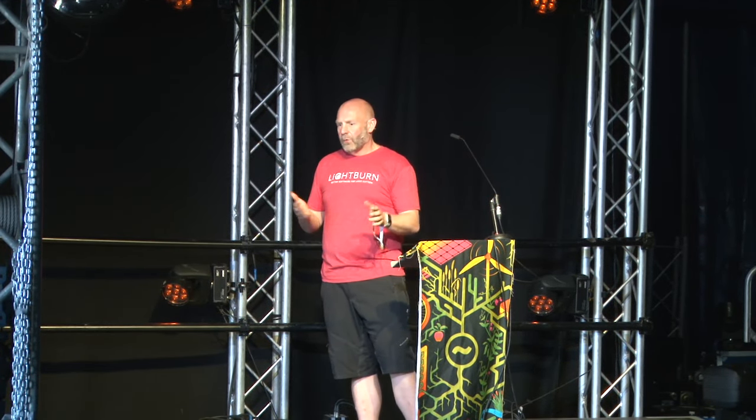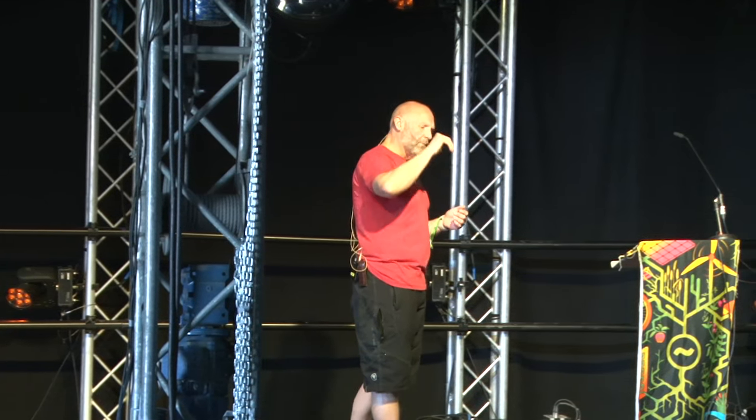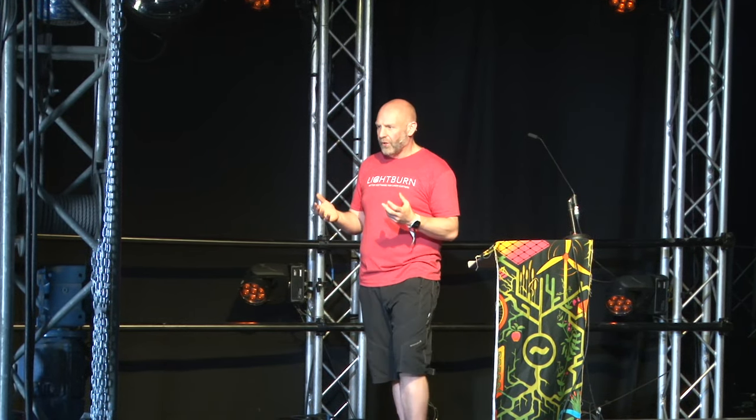As for blinding laser beams, within the confines of your laser's enclosure, the beam should only ever be travelling between a few mirrors and a lens, and the focus part of the beam will be facing down right into your workpiece. Often the focal distance from the lens to the workpiece is 2 inches or 2.5 inches, no more than that, under 60 millimetres. And that's where the real energy and focus of the work is. Of course, you shouldn't take any needless risks. You shouldn't defeat safety features. You shouldn't direct beams out of the case for fun, unless that's your cup of tea. But if they are your concerns, the machines are designed to ensure that you aren't interfacing with that laser radiation.